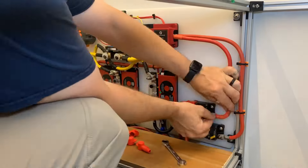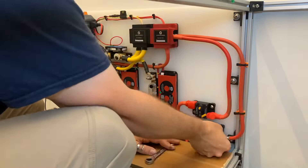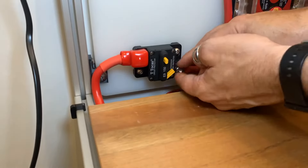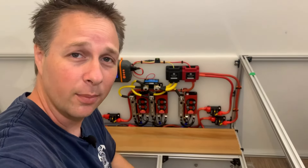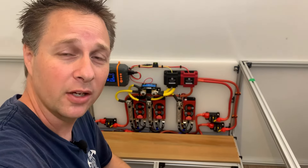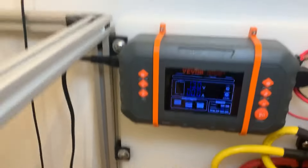If you're building something similar and you're looking for nice little silicone boots like this, I'll leave a link in the video description. After shutting the breakers off and trimming the boots to the right size, they're easy to slip into place. They only take a couple of seconds to install each, so it's a pretty quick job overall. It's a simple little thing to do — cleans it up and makes it safer. Just remember when you're done to go back and torque those nuts to the manufacturer's specs for the breakers. Now all we need to do is turn them back on and we have our voltage back.